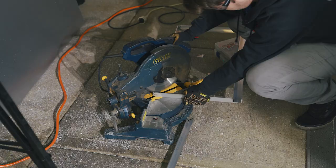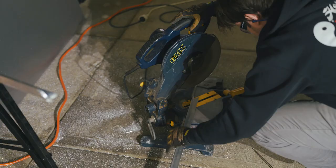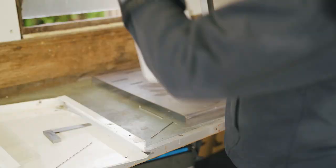After test fitting the centre frame, it showed the starboard side frame was short by about 5-6mm. I removed the frame and cut the inside section out, then cut a new section of extrusion 5mm longer to weld back into place. I hope you don't mind me showing you my stuff-ups, because I share them with you to show that it's only natural — there are plenty of ways to circumvent issues with some creativity. Never be daunted about getting your hands dirty, because experience is something you don't get until just after you need it. With the new extrusion welded back into place, the frame went back into position and slotted together millimetre perfect.